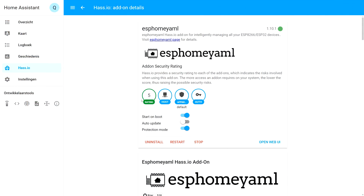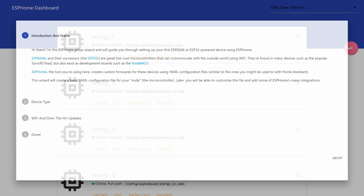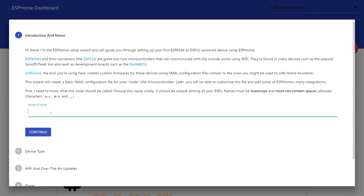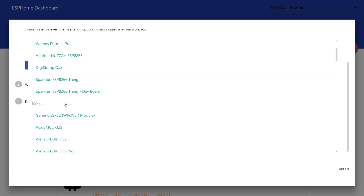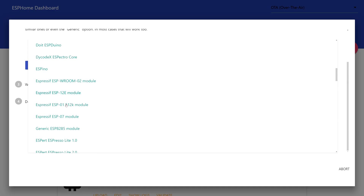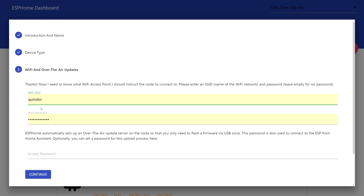Once you have that, open it up and you can follow along. When you open up ESPHome, we're going to create a new configuration — in my case I'm going to call it temp_flash. Here we select a generic ESP8285 module, and make sure your values for the Wi-Fi SSID, password, and OTA password are correct. The rest we're going to configure later on. I'll have a blog post linked in the description which will have all the text fields in there so you can copy them easily. Once you have all that filled in, hit the three little dots on the right and hit compile. This will build the ESPHome firmware and give you a binary file we're going to use later.